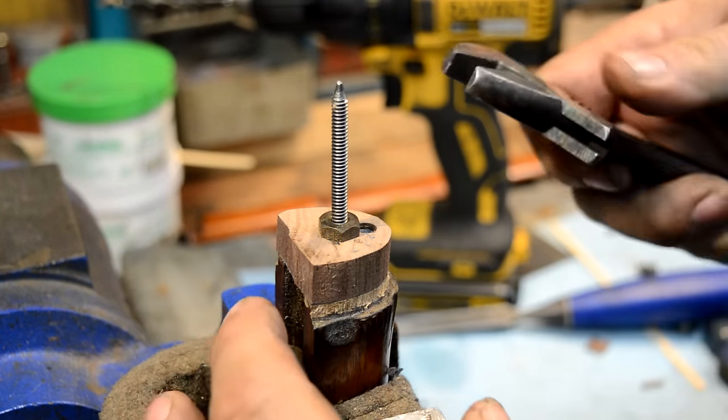Okay, and we got that, that's flat across here, so I think we actually scored. The inside of this channel is glass. Hang on a minute, let me get this set just right in the vise here. So the inside of this channel, what we've done by running this glass from here to here is created what amounts to a shear web across the top. Not a shear web, but more of a tension element. This glue here has become part of how we're getting load around this, because we're going to grab the gun up here and be able to move it around. You can see here, I can move this whole stock. Nothing's moving. I mean, this is working pretty well here.